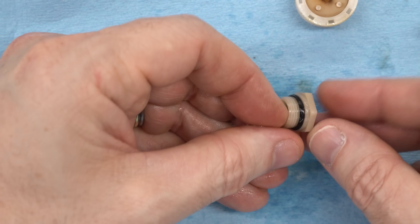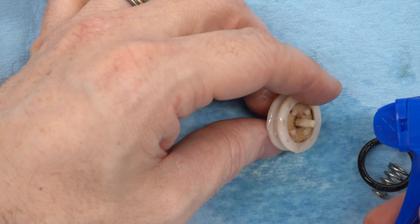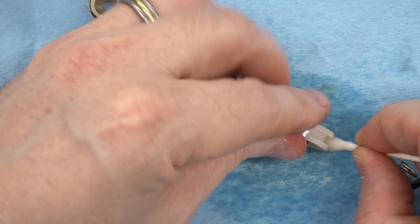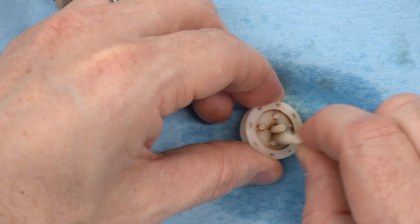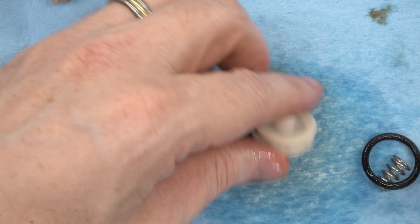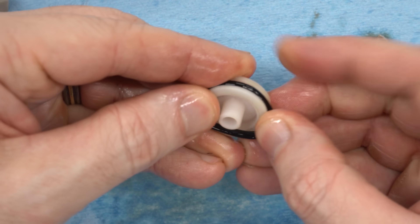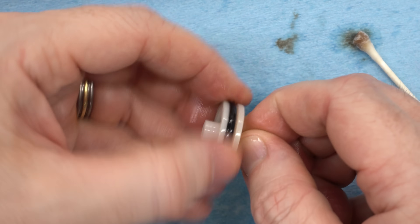The piston here looks really good — I don't see any damage on it, it's nice and clean. We'll just scrub out any of the grit. There is a bunch of staining on the backside — I think this is just the rust preventative that's in the tank. This is what the water looks like when you drain it, but that cleans up. It's not really a functional surface anyway, but we'll get the O-ring wiped off and make sure there's no grit anywhere on that. That feels fine. Get that seated back into the piston — this all looks good. I think that is ready to reinstall.